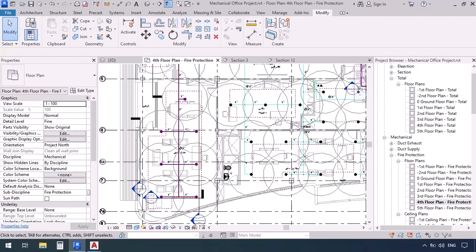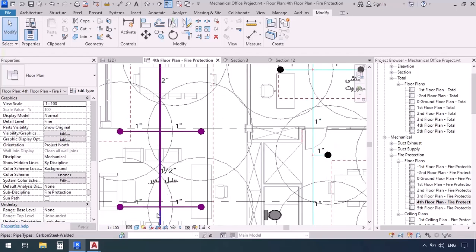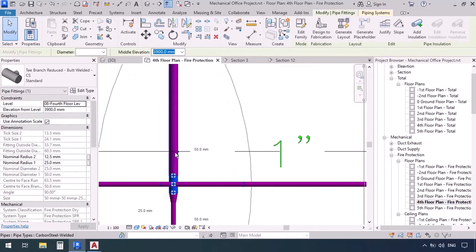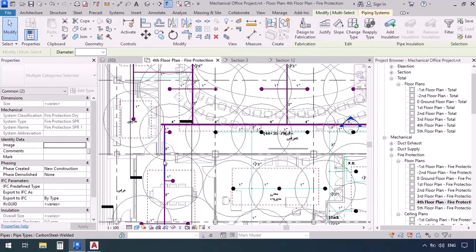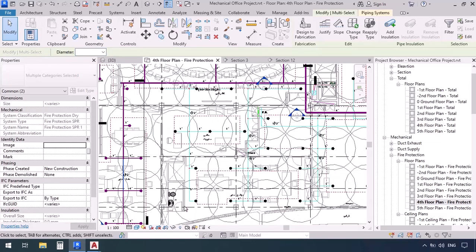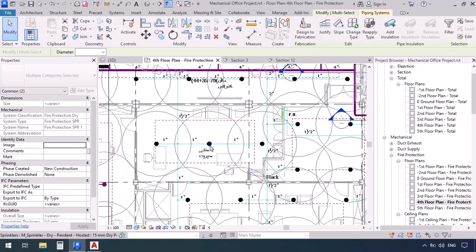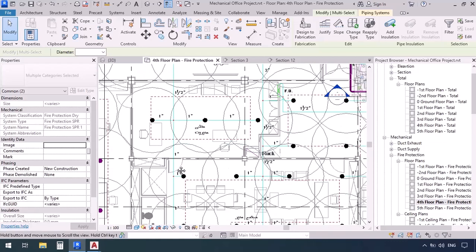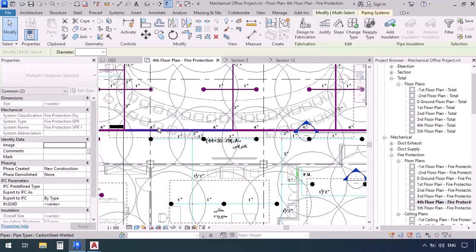We also had to readjust the diameters. Now I'm going to hold the control key, then select this T and this pipe, then change their diameters to 1½, which equals 40. As for these, their sizes are already 2 inches. Now about this line — we don't have anything yet to copy. We only have this sprinkler and two others — one on this side and two on this side — and all of their hosts are different. So copying may not be a good choice for us here, but first I'm going to try to draw this line.